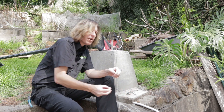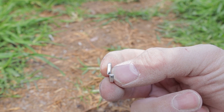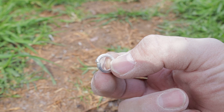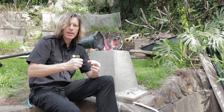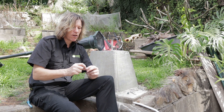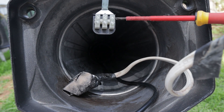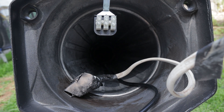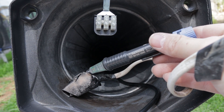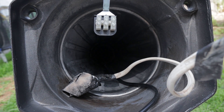I'll also put on a spring washer. It's called a spring washer because it has a little cup and it's made out of spring steel, so it's always trying to push outwards. When you tighten the concrete bolt down you're squashing the washer, and because it's forcing back it locks into place. We use spring washers a lot in anything we don't want to come apart. You can see here the terminal strip I was referring to — we will connect the cable into here. I'll test that with my volt stick — you can see that's live. So I'm going to go through my seven steps of isolation and isolate that so it's safe to work on, then terminate that in, prop the lamppost up, and put in the concrete bolts.